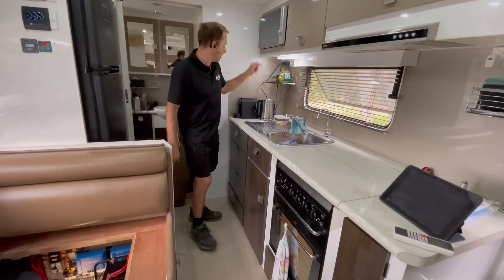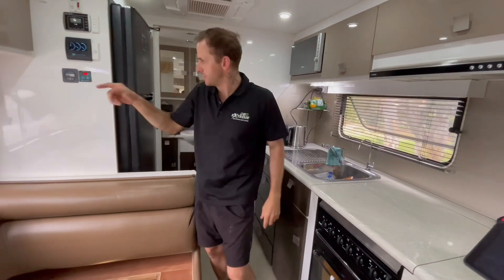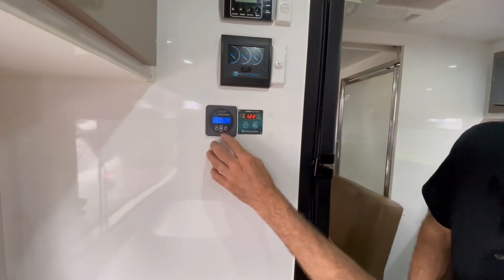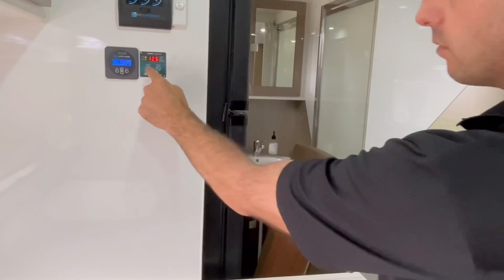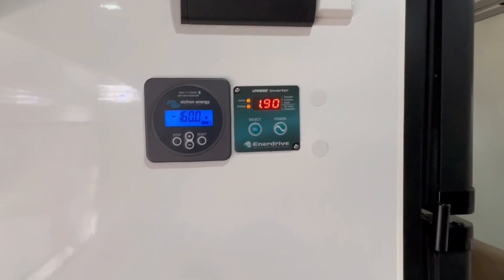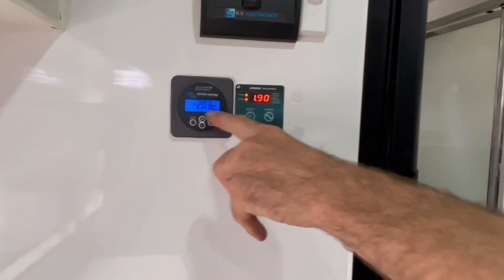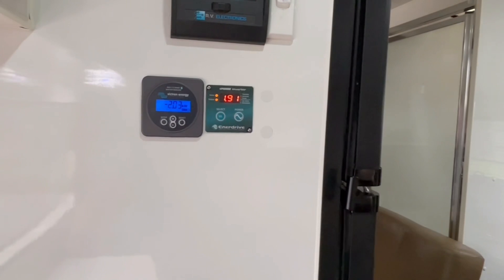I'll put on the microwave and show you what things run. I'll switch over to kilowatt so we can see — we're not using any energy at the moment. I'll put it on for a minute. This is the microwave running — that's what we're pulling in amps — about 1,200 watts. Now kettle only: look at what the kettle pulls. It's monstrous — that's a 1,800 to 2,000 watt kettle. That's just over 2,000 watts coming out of the battery, slightly higher because we're running lights and other stuff too — the difference in those numbers is the DC lights and everything running.